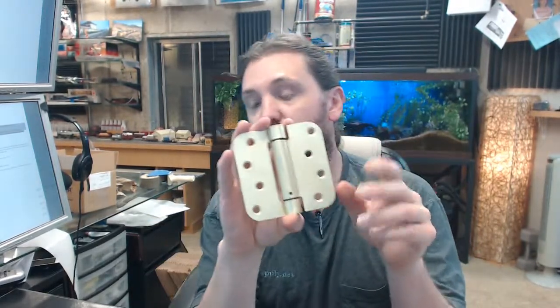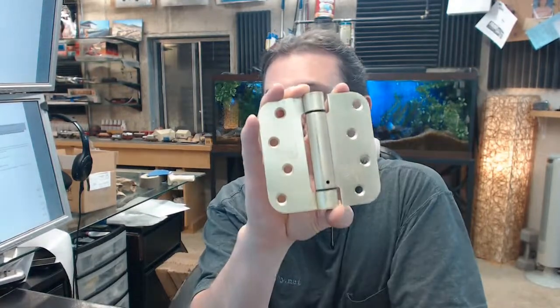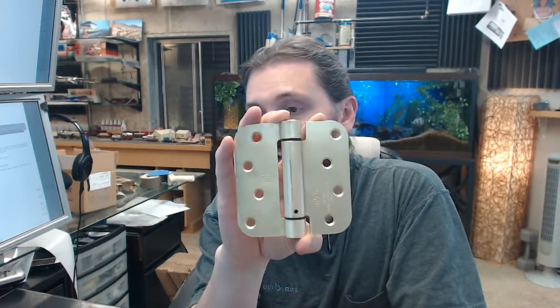Specifications. This hinge is full mortise, as we discussed earlier, and steel base. The gauge of the hinge leaf is .097. That's 97 thousandths of an inch, typical for residential applications. The preparation of that is shallower than a typical 4x4, which is closer to 130 thousandths. So if your hinge prep is well less than 1/8 of an inch, this is what you need. If your hinge prep is heavy on 1/8 of an inch, then you need a commercial grade hinge. This is therefore classified residential weight. 8 holes includes those number 9 by 1 inch flathead wood screws.